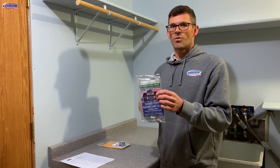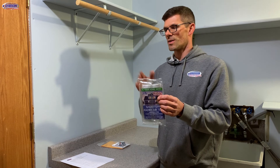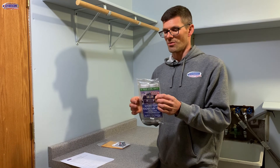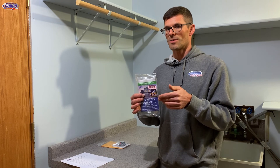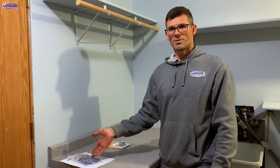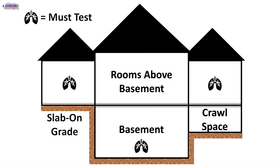Here you've got an Air Check radon test kit. This is a short-term radon test to see how the radon system is working after mitigation. You can set this up 24 hours after the system has been up and running. We'll include a link in the description to a video explaining exactly how to set this up. If you have multiple radon test kits, it may mean your house has multiple foundation zones, so set one test kit in each foundation zone.